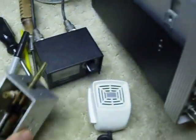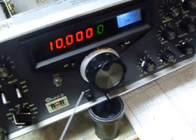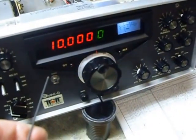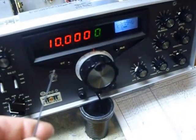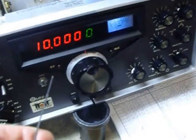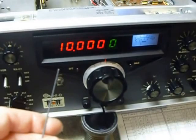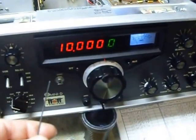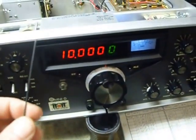Anyway, I did all that to the PTO that's in the unit, and as you can see it's just sitting there rock steady on 10 megahertz. Well, it was not rock steady when I put it in there — it tended to drift. I'd turn it on, let it warm up for half an hour, and it drifted, and I really didn't care for that. I'm used to a rig that's crystal-controlled, synthesized, and would stay put.